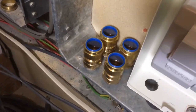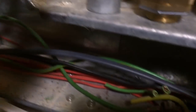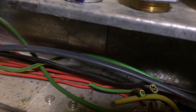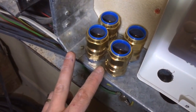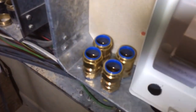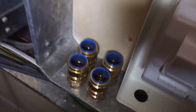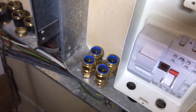Just a little trick for marking these out — it's quite awkward to try and get a pen around there. So obviously check what size your hole is going to be; this is a 25mm, so get yourself a 25mm coupler and then you can draw around that a lot easier. Get it equally spaced and it'll be perfect. Four holes drilled there now — just remember to leave enough gap so you can actually turn the gland when you're tightening it up. Next we're going to bring the armoured down the tray, turn them to the wall, and gland them off into these glands.